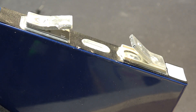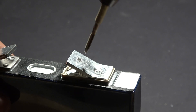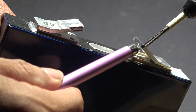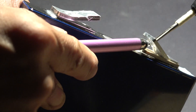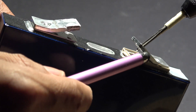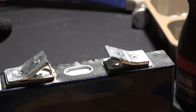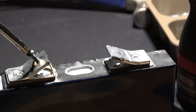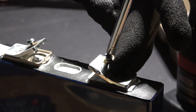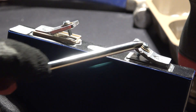I've got my hole drilled right through and now I can tap it. When I tap it to make a thread, the tap goes right through the hole — about two millimeters sticking out. So if I hadn't lifted this up it would have already shorted out the bottom. Here we go — I've got the two holes tapped. Now I can put a screw through it. One screw here, one screw on the other side.